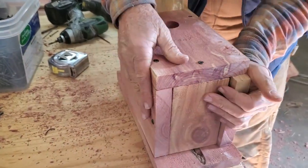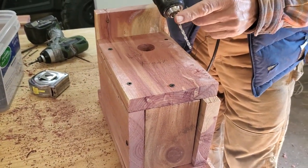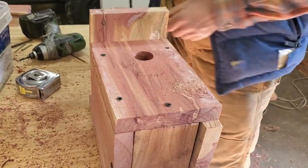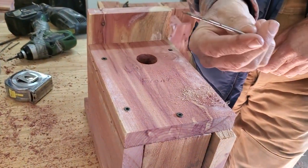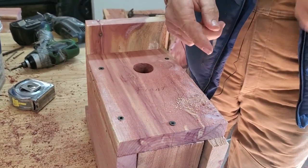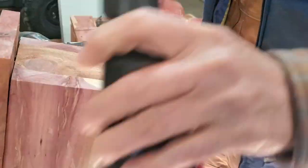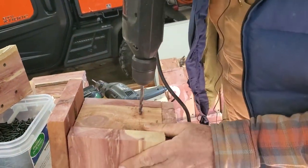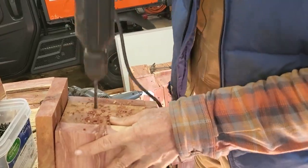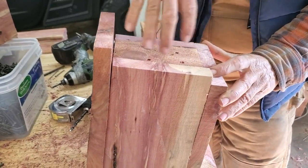Now I've only got one thing left to do — turn it up on its side, bottom facing down, and put my latch in. I've got my awl-type drill bit and I go at an angle, because you want your nail to go down into the wood. This should be a galvanized 10-penny nail — a 16 is too long, you need a 10d. Now the only thing left is to put vent holes in the bottom of the birdhouse using a quarter-inch bit.